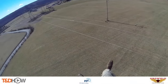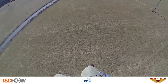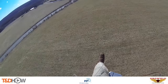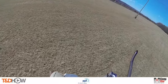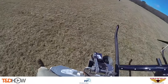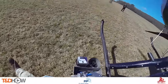And so now you have seen our TND How Video on how to find and fix failing overhead splices. You have seen the initial discovery of a high-resistance splice using infrared thermography, followed by an ohm stick inspection and verification, and then permanent restoration to better than the splice's original integrity using a Clamp Star shunt splice. Our participating utility was PPL Electric Utilities. Sponsors included Classic Connectors, makers of the Clamp Star shunt, Haverfield Aviation, SensorLink Corporation, and Hotshot Infrared Inspections. I am Jim Ducart with TND How Videos — thank you as always for watching.